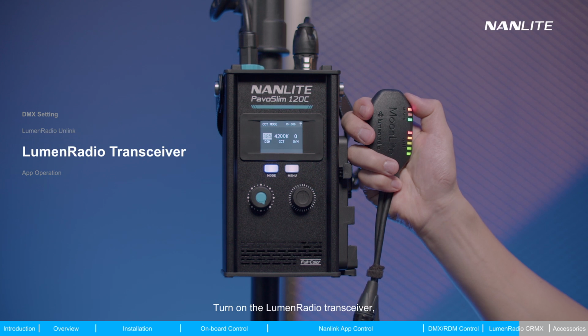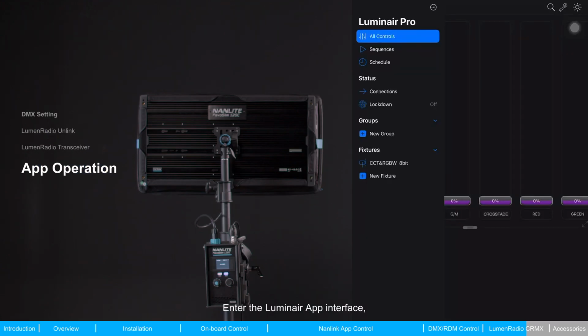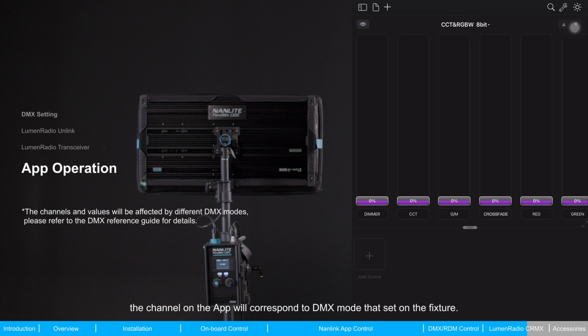Turn on the LumenRadio transceiver. Connect the fixture with the Luminaire app. It shows DMX controlling, which means the connection is successful. Enter the Luminaire app interface. The channel on the app will correspond to the DMX mode that's set on the fixture.